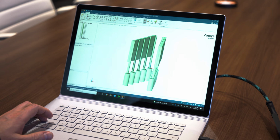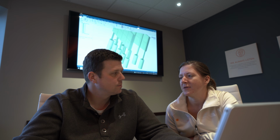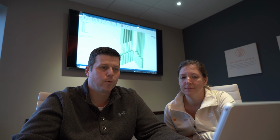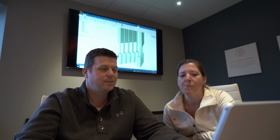We originally, for the lower one, you'll notice, had individual sonotubes poured for the footings for each one of these. And Beth didn't like that so much. We decided it would be a little inefficient and harder to lay it all out, and I think you were right in the end. Getting those sonotubes perfectly straight, setting on the footing, and making them work would have been really difficult. So we ended up turning these into a stem wall and formed up a footing, set the stem wall on top, and then it was basically just one continuous piece of concrete, which made it really easy to install the sign on. So yeah, that's the design.